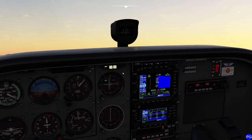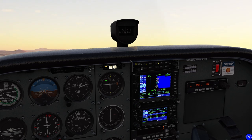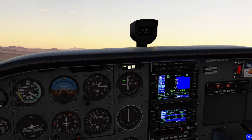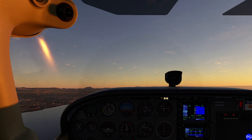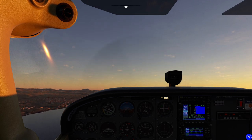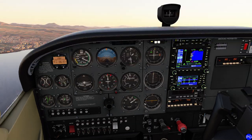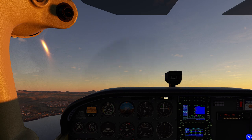Guess what we just detected — listen to the beeps. We've picked up our VOR signal. It looks like we're a little off course and need to come to our left just a little bit, which is what I expected. VOR and GPS basically give you the same kind of information — it tells you how far off course you are. I'm just watching this needle in the middle slowly hiking its way toward center. I'll turn up the brightness on the panels so you can see a little better.